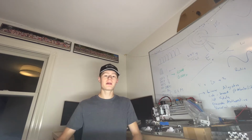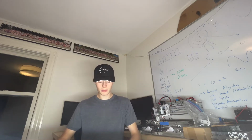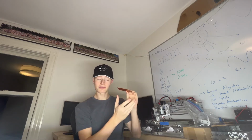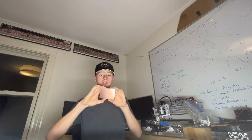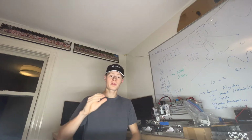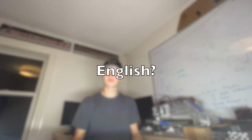The way I'm going to go about it in this video is through a process called CNC routing. CNC routing is when you start with a board like this, where you have a very thin layer of copper and a much thicker layer of fiberglass. To actually turn it into a circuit board, all we have to do is use a CNC router to actually drill out areas of copper so that we can create lines or islands of copper with which you can connect other components to.